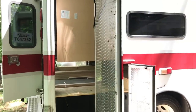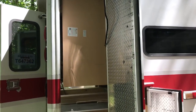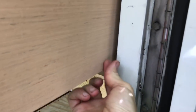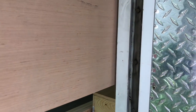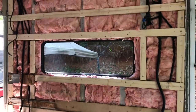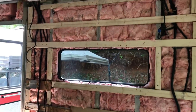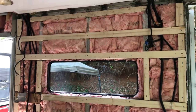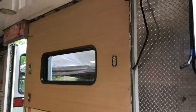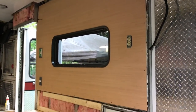Here's the outside door and you can see the overlap, so I'm going to take a pen and trace out the opening. When I take the board out I'll see how much more I need to go past the edge to get behind the trim piece. One thing I want to make sure to do at this point — especially since my walls are irregular — is take pictures of where I put the boards so I know when I put it back up where my boards are and where I can screw into them.